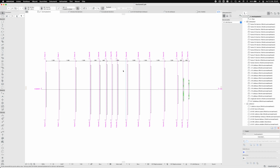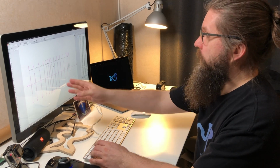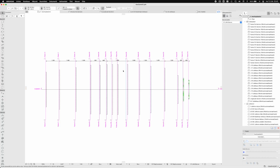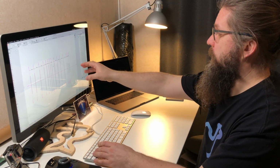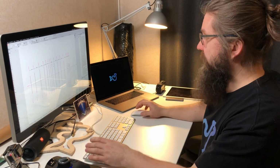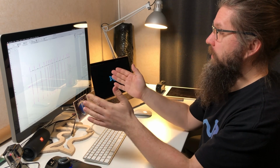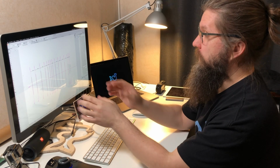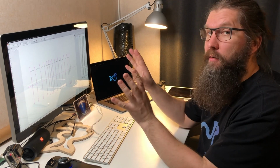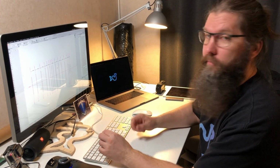The first two are 1A and 1B because they are on station 1. And then in the middle there are 3 frames that are 7A, B and C. So they are on the middle mast, and these 3 forward ones are on the forward mast. So that's the basic layout of the frames, and they are not uniformly aligned. They are in the places where there is a bulkhead or something else, or just a proper gap between. So they are where they are, and their places are fixed now, so these won't change anymore, I hope, because, you know the drill.